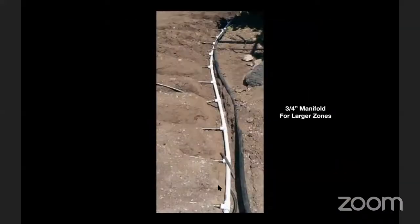And so here is an example of what that would look like in person. The most common material to make that out of is just the normal PVC plastic that you would run a normal sprinkler line with. And then there are adapters that will bring it over to the drip type of line. However, this really needs to remain buried, and sometimes with drip line, this part wants to be closer to the surface. And it also requires gluing and all sorts of other things that homeowners are not always that comfortable doing.